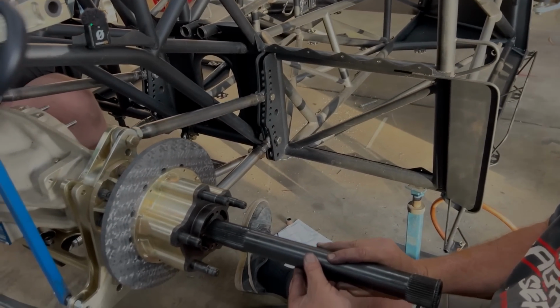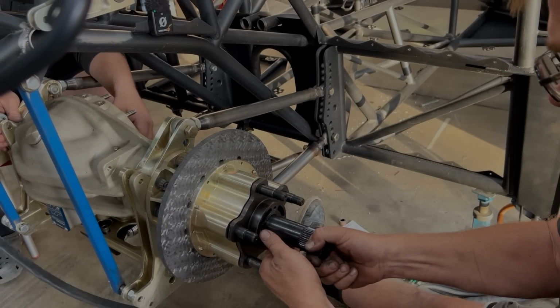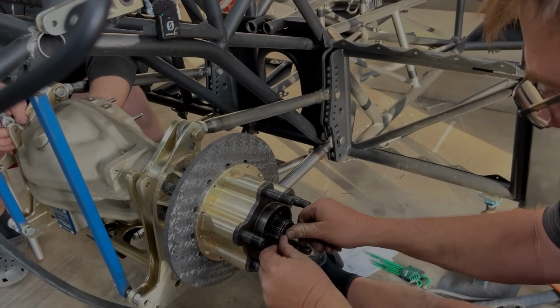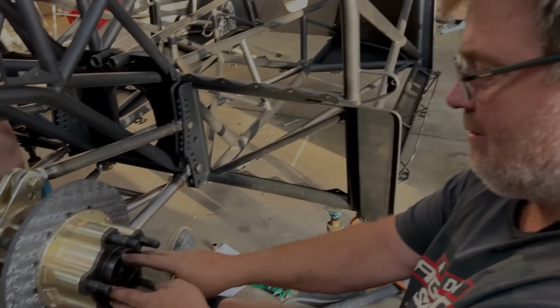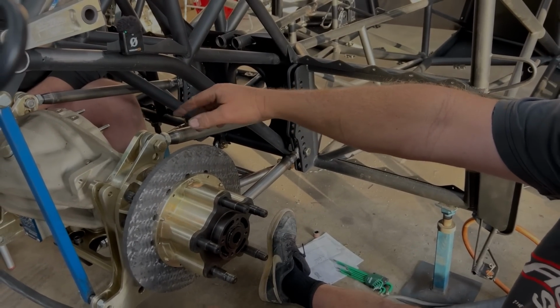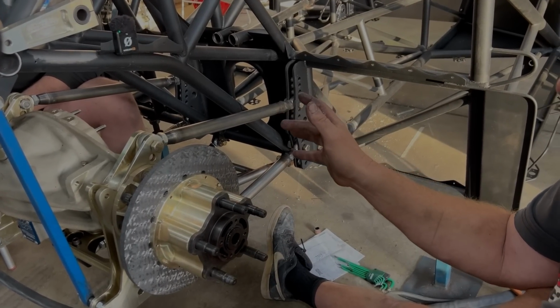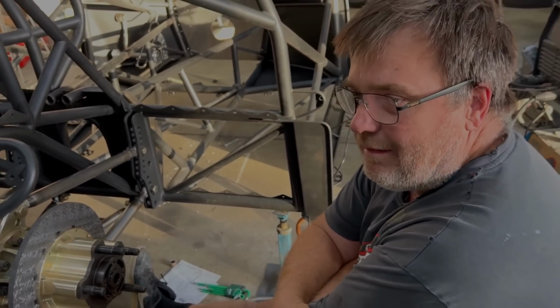So the axle then goes through the drive plate, and that goes in there like that. Comes right through, locks in, and the axle runs on that drive plate. You break the axle at this end or even at that end, and the wheel still rides on those two bearings and no wheels come off or anything like that. So that is a floating rear end.